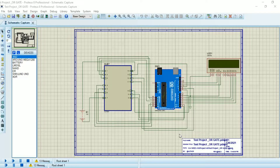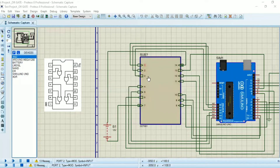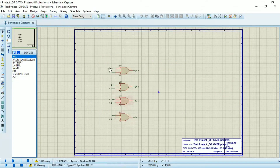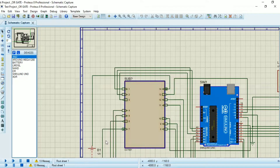In our project simulation part, we use Proteus for circuit simulation — using Arduino Uno and an LCD monitor. As there are no logic gate ICs in Proteus, we made a sub-circuit for different ICs, taking the pin numbers as mentioned in the IC datasheet. Inside the module, we see four OR gates with inputs and outputs labeled according to the datasheet. When all four logic gates match, the output will be shown. Pin 14 is the VCC port and pin 7 is the ground connection.